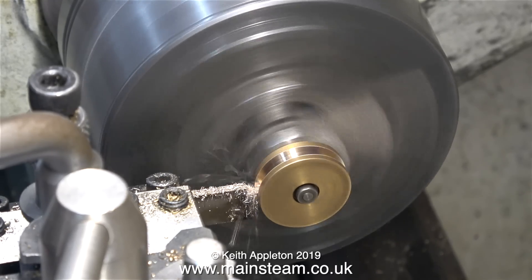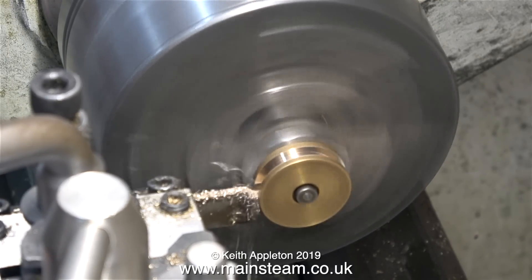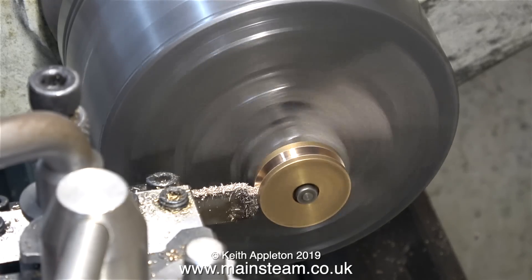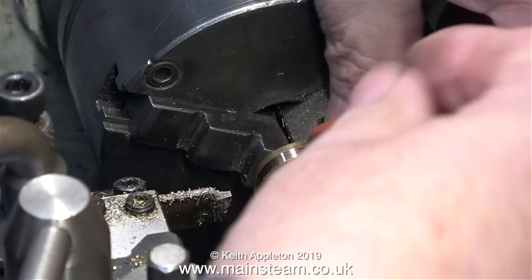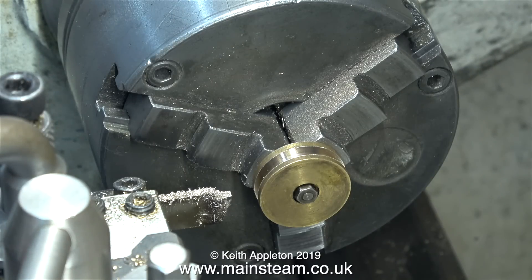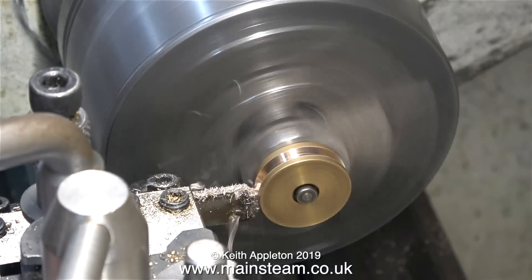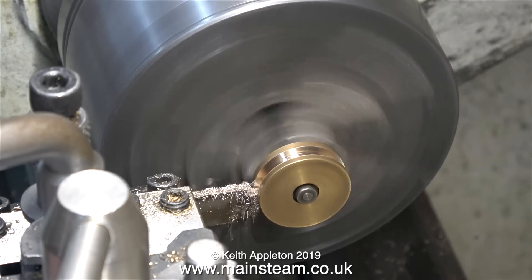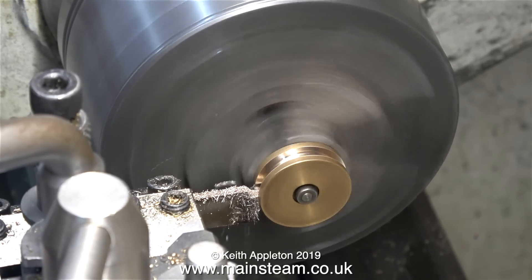For the moment I'm not going to do that, and I have a bit of a problem too — my lathe's motor is on its last legs. It's been a bit weird for a while, even in the last workshop. I can't get a setting on the three-phase converter that makes the lathe start smoothly. Sometimes the boost stays on, which is very bad because it will burn the motor out. So I think what I'm going to do is either buy a new lathe, or put a new single-phase motor in the existing lathe, which means I need a single-phase contactor, etc. I miss the Smart and Brown — really, I miss the physical size of it.